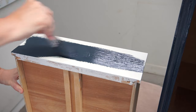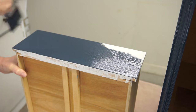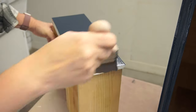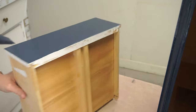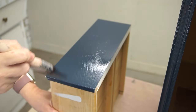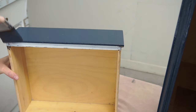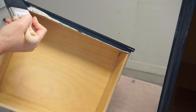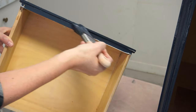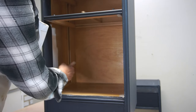A quick tip when you're painting edges: go at them on an angle, as I'm doing here on this drawer. I use my brush and go in on an angle, and this way no painter's tape is required if you're trying to do a crisp edge. After I get the paint on, I then go ahead and do the lips of the drawer, making sure the paint is all evened out. I use the tips of the brush to get into the crevices and the lip of the drawer. If you have a really good paint brush, you shouldn't have any problem using all aspects of it — the tips, the big broad side, the corners — and it really makes a huge difference in how paint is applied.